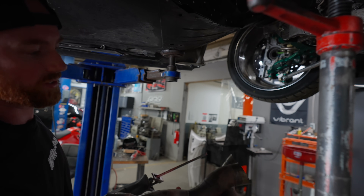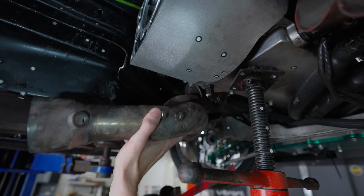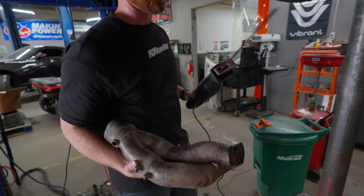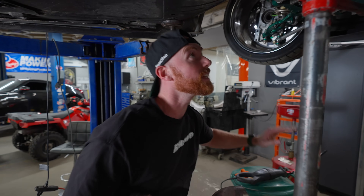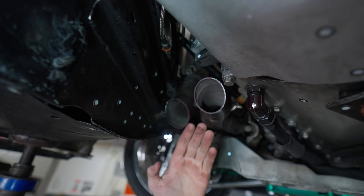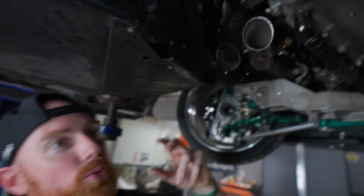After I started the cut, I then took a blade from another sawzall and stuck it in the cut — I'll show you this on the computer. What that gave me was a cut plane, and the reason I need a cut plane is in the computer I need a flat face to select a plane so that I can eventually create flanges. The idea was I was going to add flanges somewhere along the exhaust system.